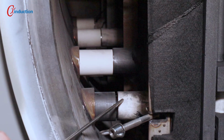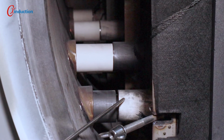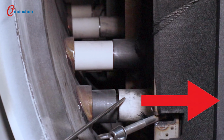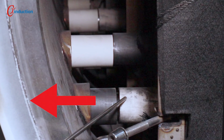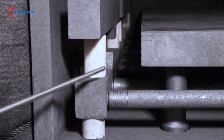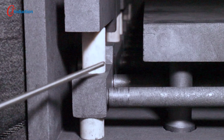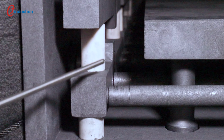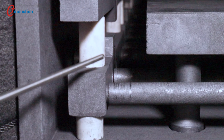These are the electrodes for incoming power, which are connected with the left side of the heating elements. One end of the electrodes connects with the heating elements and is made of graphite, and the other end connects with the supply transformer and is made of copper with water cooling. Corundum insulates the insulation layers, the stainless steel shell, and the 2 poles of the heating elements. A safe distance should be maintained between each group of heaters and the carrier platform.